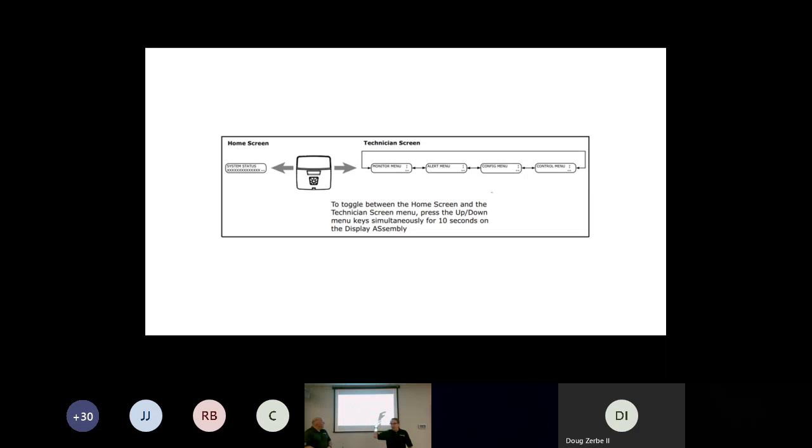The biggest situation that takes place in this unit, depending on whether you're putting straight electric heat in, or if you're doing a heat pump with auxiliary backup heat, is you want to make sure that you program this unit to say what size electric heat you have. It starts off in what they call a parked position. If that unit says all of a sudden that my W's are energized, but you told me I have no electric heat, well, how can I turn on what I don't have? Therefore, I now have a fault. And it's going to give that.